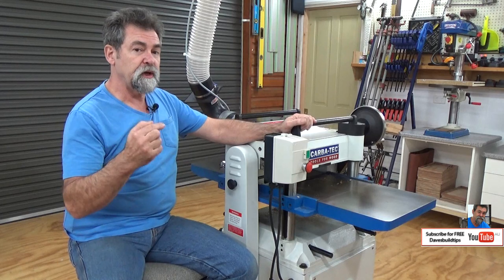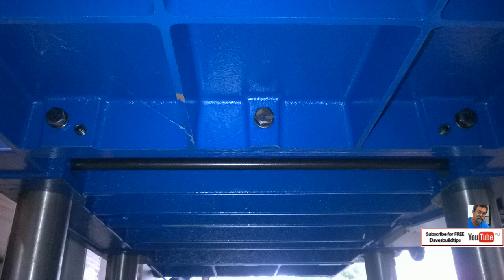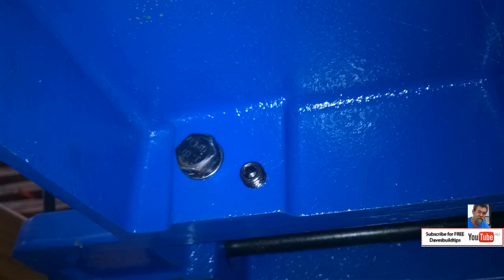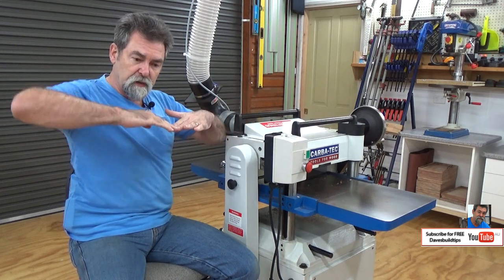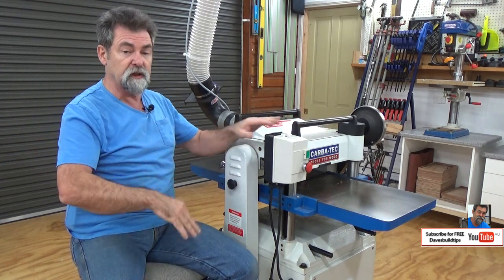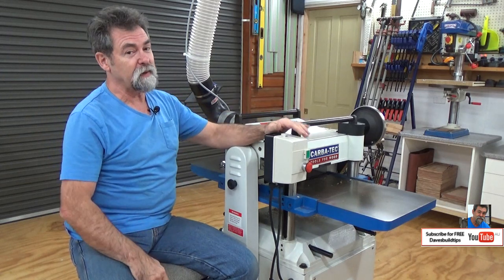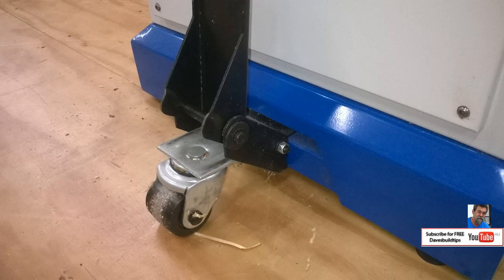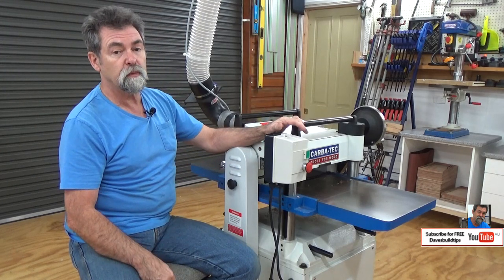To put those on, there are three bolts that lock the infeed table to the main table and three bolts that lock the outfeed table to the main table. Below each of those bolts is an internal hex drive grub screw. They are designed to tighten up and adjust the infeed to the main table so you can get it dead level. Run a straight edge across and you'll be amazed how they adjust — they pop the table up unbelievably well. Also included is the jockey wheel, so you can move the machine around your workshop.